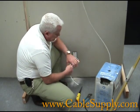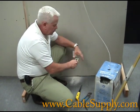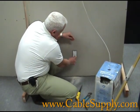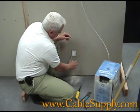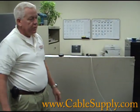If you're in a new building where the walls haven't been painted yet, just wrap the extra wire up and leave it right there at the bracket. When they spray the wall, they won't paint over your faceplate and jack.